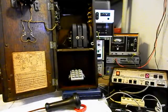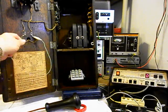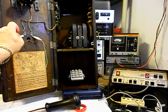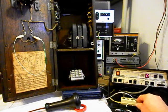Now what we want to do is go ahead and use our keypad and dial our numbers out, but we want to short the transmitter out. If we do not short the transmitter out, we will get a feedback through our transmitter. It's very high quality and it has a high power of transmit, and what will happen is it will cause a feedback in the amplifier.